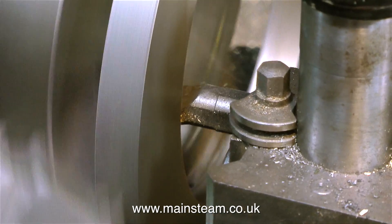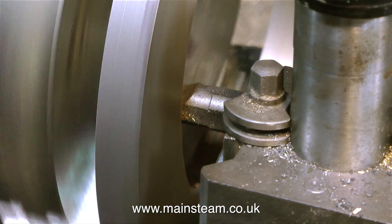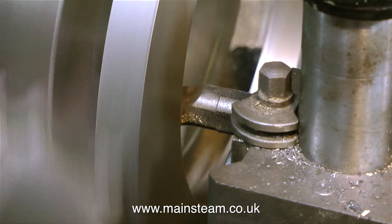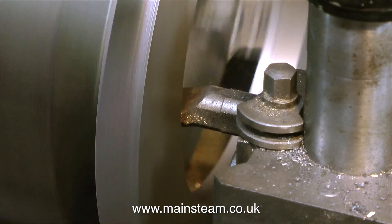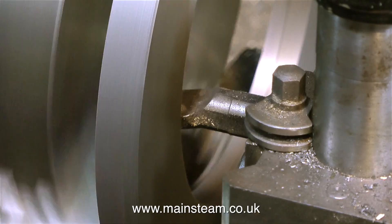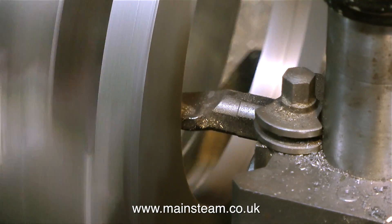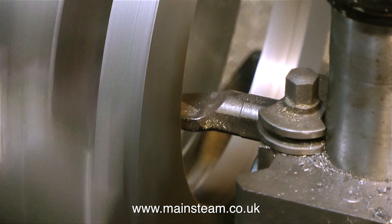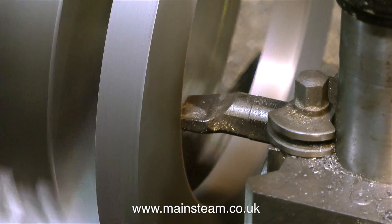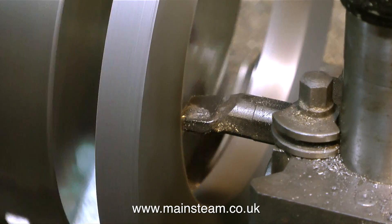By holding one of the machine surfaces against the chuck jaws, I use the soft hammer to tap it firmly into place. You can tell by the sound of the hammer on each of the four chuck jaws when the piece of metal is firmly sat up against the jaw — if it makes a ringing noise, it's not. So now, using a boring tool, I can bore all the way through the centre. Generally speaking, when I use a boring tool I go all the way through the work at quite a fast traverse speed to get it to the final size. Once through successfully, I stop the lathe, select a slower traverse, and reverse the direction so the tool comes away out of the work without touching the cross-slide handwheel — this takes a very fine cut and usually gives a very good finish.